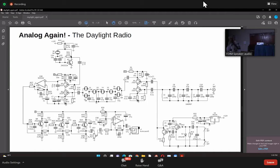If you don't want your friends using your radio behind you, you can just remove the tuning knob and take it home. Just put it in your pocket and say, okay, go on, use this. This version actually has a latching relay which could change bands, but it's a fairly simple thing to do. It 3D prints in 5 minutes. You don't have to go for a variable capacitor or a slow motion drive. And I think this is the easy way of building VFOs now.